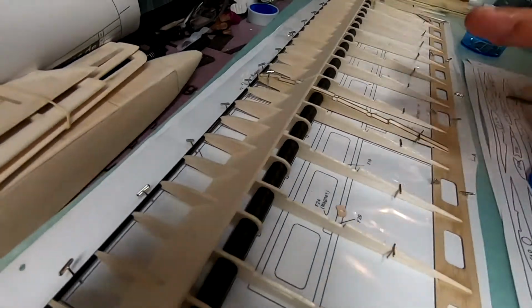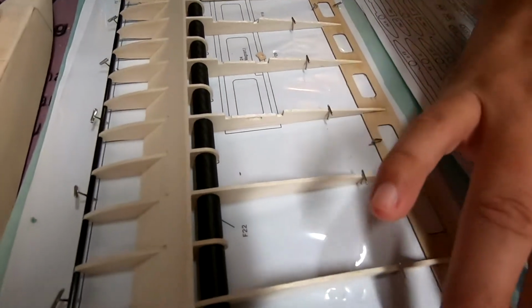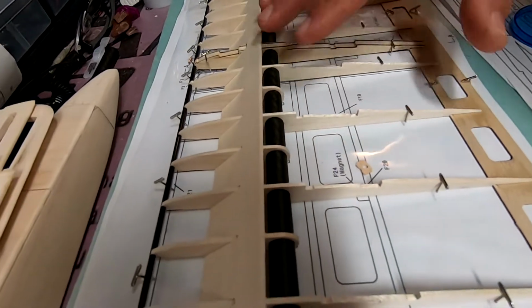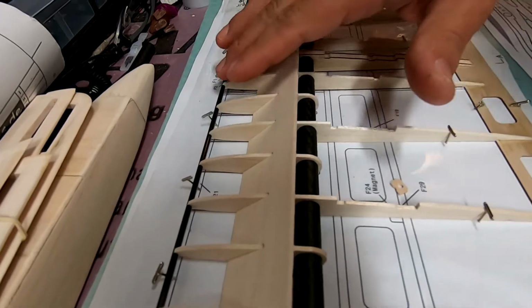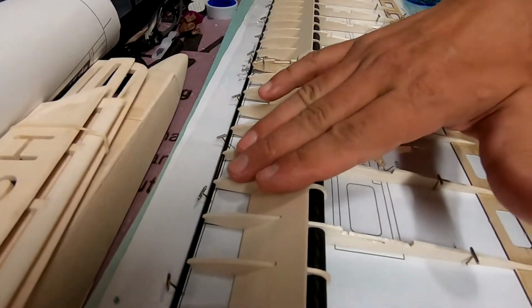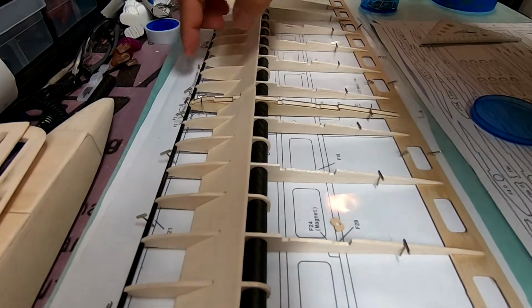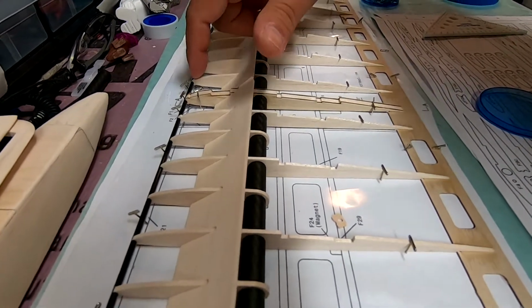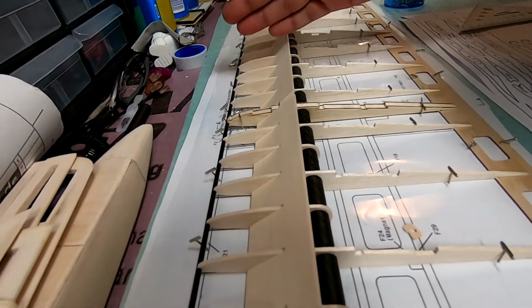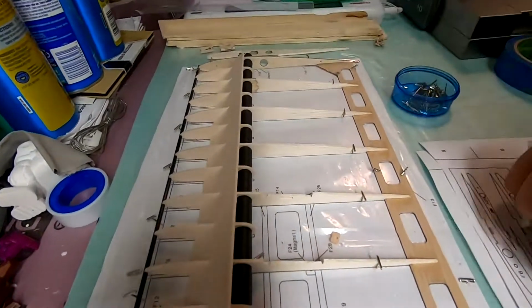And this is just a great kit. I really love it. Everything is very, very precise. As you can see, having lined up the rear edges of the ribs, notch to notch, properly, and gotten everything angled correctly, not only the vertical angles on these, but there's no distance between any of these. That's something you don't always see in a kit. The CNCing is very precise, the design is very precise, and it takes very little pressure to hold the carbon fiber rod fully and completely into the cutaways on every single rib. There's no rib that is a little back from the edge or pushing a little further out and needed to be handled or trimmed or ground.